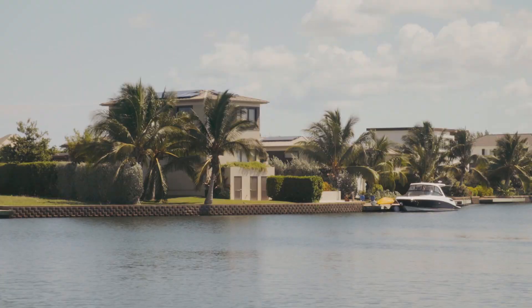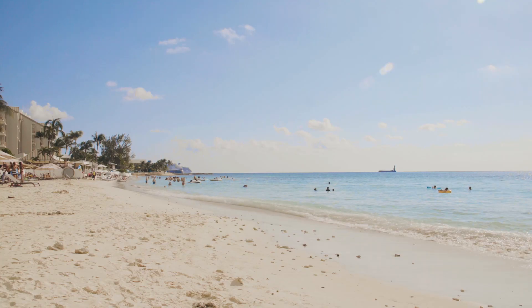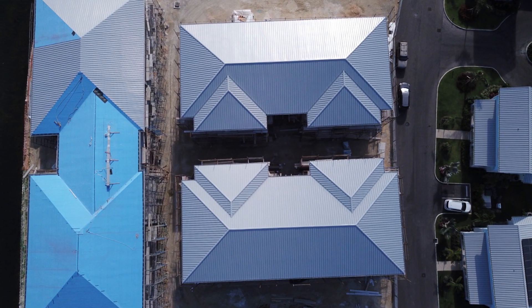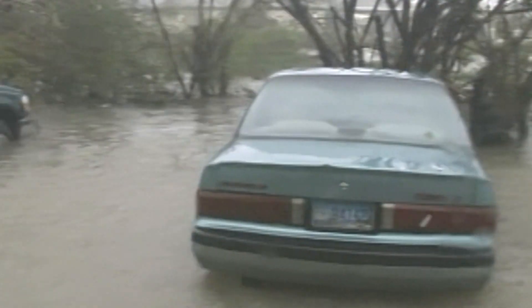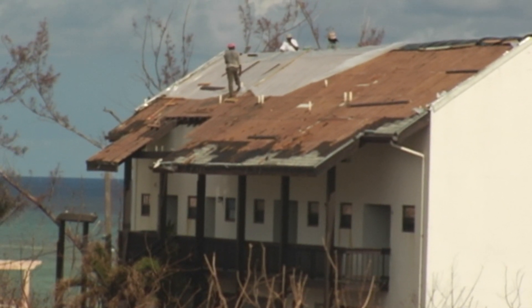When I was in the Cayman Islands a couple months ago, they were saying that the islands have really transitioned to ice and water shield, even in that hurricane-type environment. Can you tell me why someone would want to do that? With extreme weather like hurricanes, if something happens and your roof system leaves, you still have an adhered underlayment underneath it to protect water from infiltrating into your system.